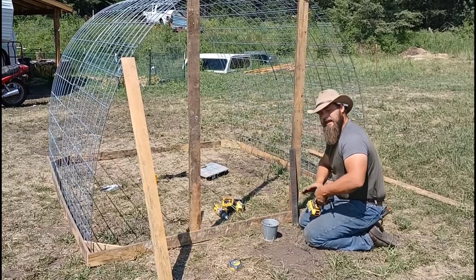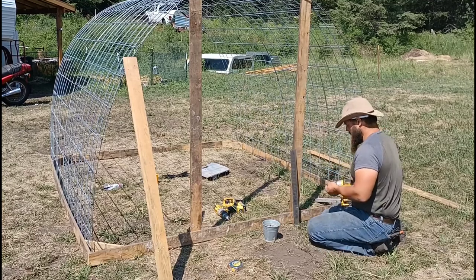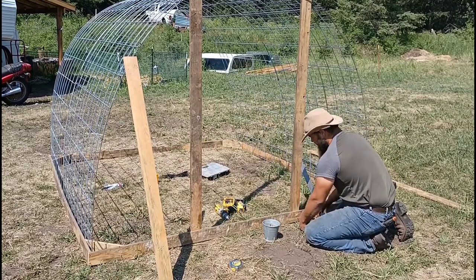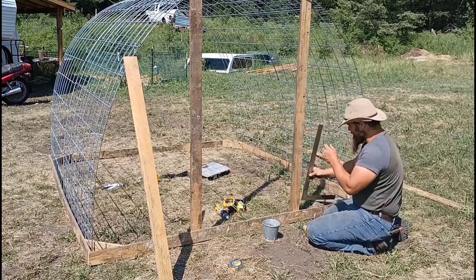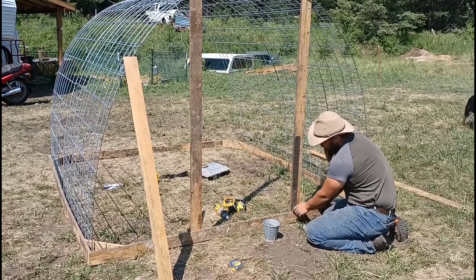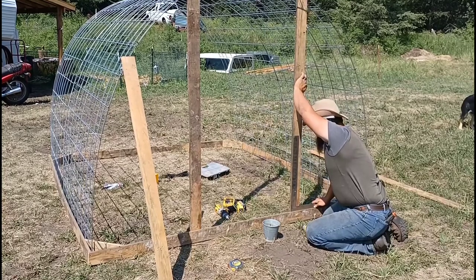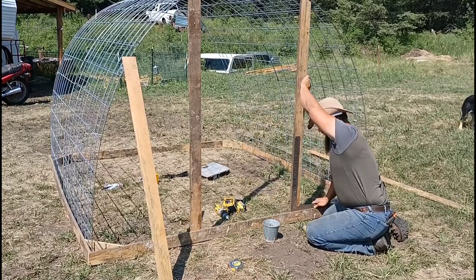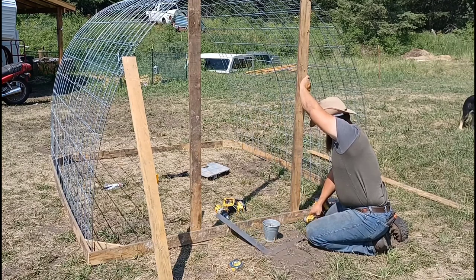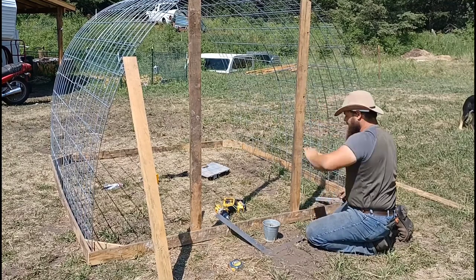That screw I rejected. It had a little bend to it. So I'll start my second screw so it's started. They're ready to go. I'll place my square back on here. I line it up with this bottom edge where the line meets. And then I grab this board and push it over until it's nice and flush with the edge of that square. Like that. And I hold it, try not to move a whole lot. And I take that screw home.